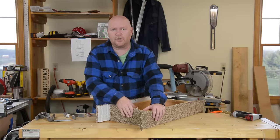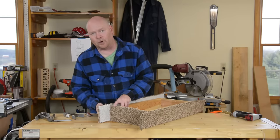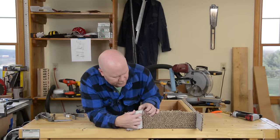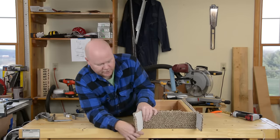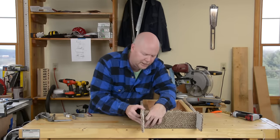With the first cut made, you can staple the side down. Then you have to go back and it's moment of truth time — you've got to cut these flaps off of the front. Basically you want to cut them so that the white backing on the carpet exactly lines up with the other side right here. This is the classic miter joint that's hard to cut perfectly in wood.